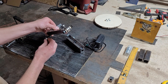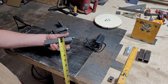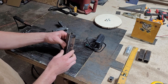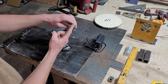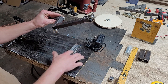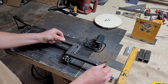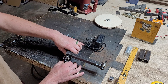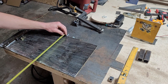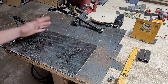For the pivot, this right here is a piece five inches long, one inch square stock on the bottom. On the top I took that one inch square stock and cut it down like this and cleaned it up a bit. The bearings sit centered in the V-block of this angle iron that's cut open, which gives a really nice solid pivot point, especially once I tack this down.